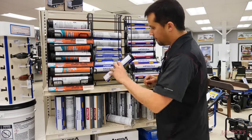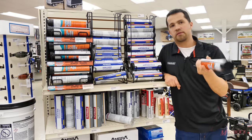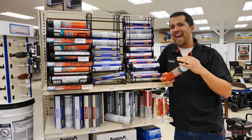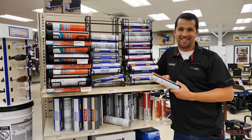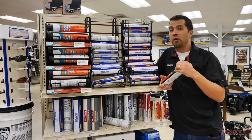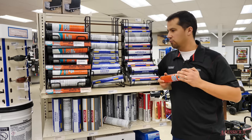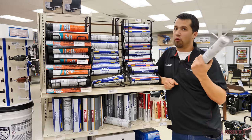There are also synthetic greases available, but these take a pretty big price jump — a tube of synthetic grease is almost triple that of a normal grease. What the synthetics give you is better wear time; a synthetic grease can last in that joint about three or four times as long as a petroleum-based grease. It's also available for livestock or food grade environments where you're concerned about contamination. But we're really typically looking for synthetics because of that longer lasting property.